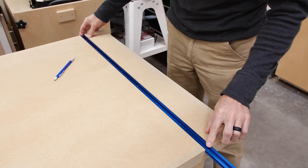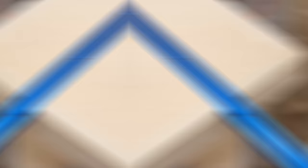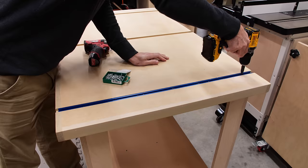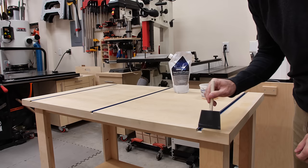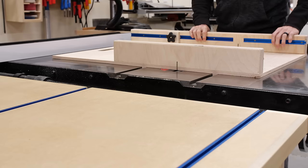I flipped the table back over and test fit the t-track into the slots. The track is longer than the table so I put it in place and marked it to size, leaving the track a little short from the ends to avoid cutting too close to the screw holes. The track is aluminum and can be easily cut with a carbide tooth blade on a standard miter saw — just go slow and let the teeth do the work with small nibbles. To secure the track I used three quarter inch number six screws. I pre-drilled and secured one screw on the end of the track first, then pre-drilled the rest of the holes without it moving, and drove the screws through. I have a self-centering VIX bit that makes this process a lot faster and ensures those screws aren't misplaced so they won't stand proud at the bottom of the track. To give the top some protection I added a coat of marine grade water-based polyurethane applied with a foam brush, wiping off any that got onto the t-track before moving on.